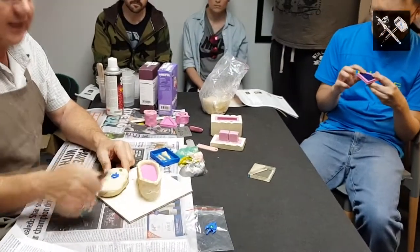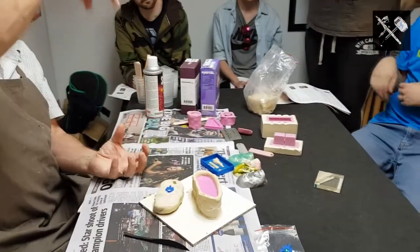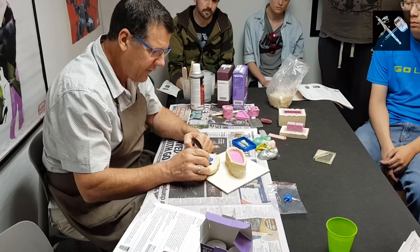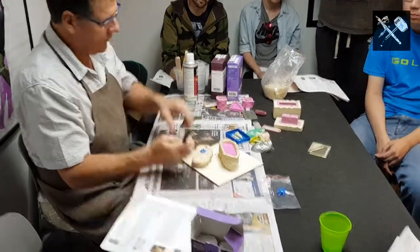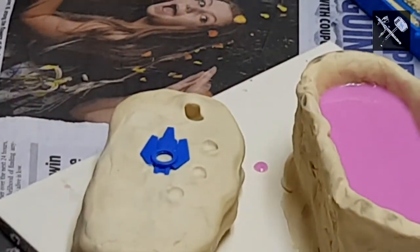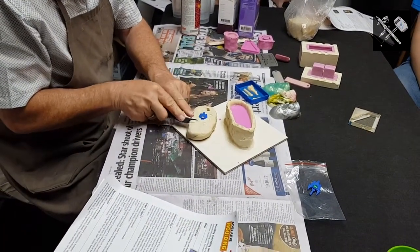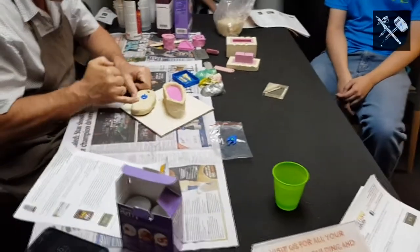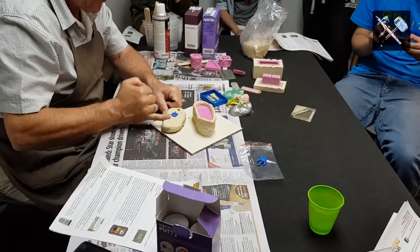An undercut is an in and under. So it needs to be able to pull parallel, clean. So any sort of mark like this, as long as you're not digging a hole in under like that, because the silicone needs to pull apart. The two halves need to pull apart. You can even go to this sort of detail if you want to. Make a V all the way around, but it's a bit fiddly, so it's a lot easier.